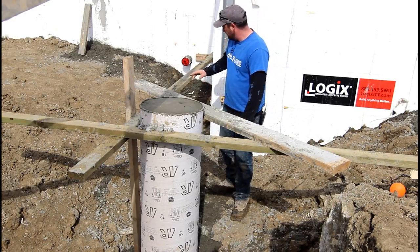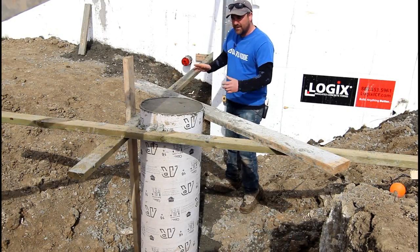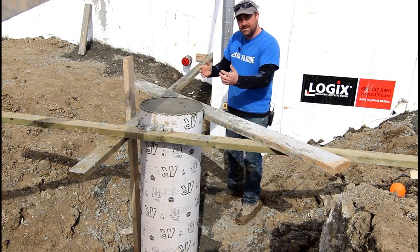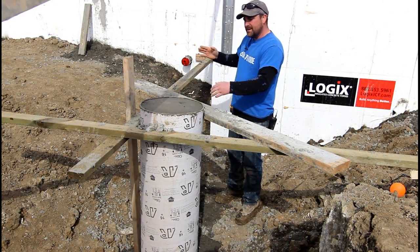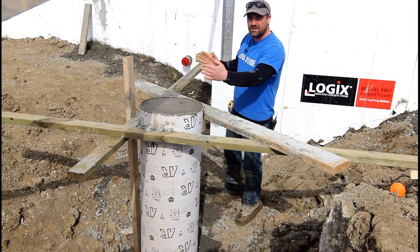You can see this 2x4 here is braced back to the wall. Everything is set off of dimension — so whatever the prints tell you to do for dimension that way — like on an ICF, if you have a bit of a curve in the wall, you set it to dimension. That way when you straighten it out, it will straighten the pile and the dimension is still exactly what you wanted it to be.